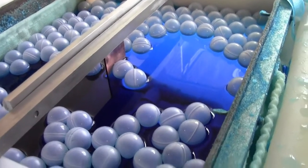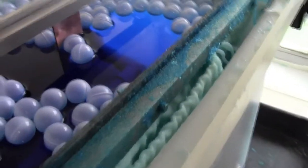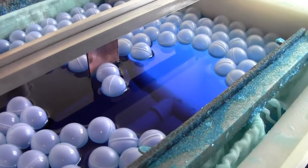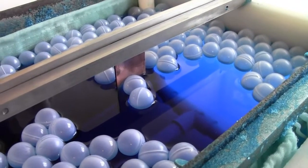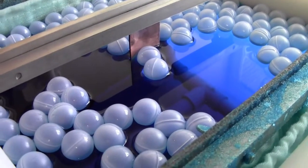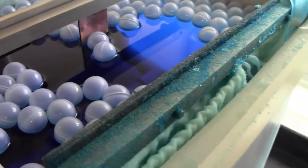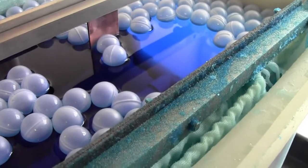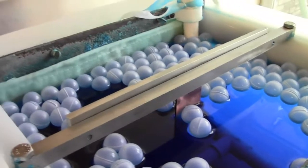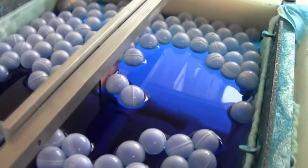And yeah, make sure that these copper panels are larger than what you're actually plating, so the power transfer is even. Okay, just like in the capacitor. You've got two plates, anode and cathode, charges separate out, same principle. If your circuit board is larger than your copper plates, it's not going to plate particularly well. If it's smaller than the plates, then it will. So that's all in there.